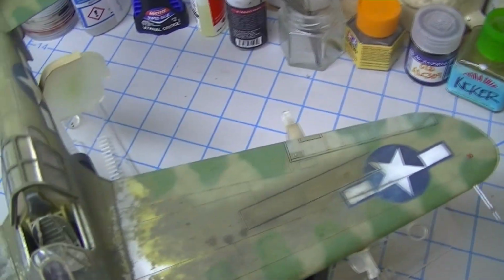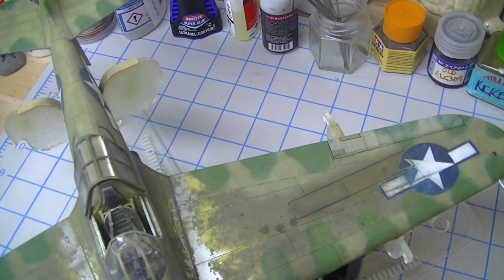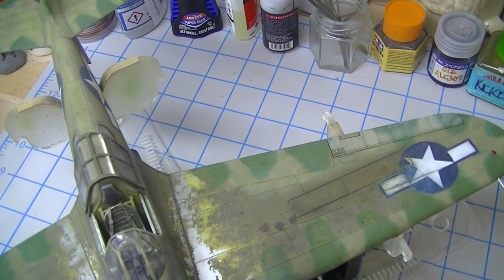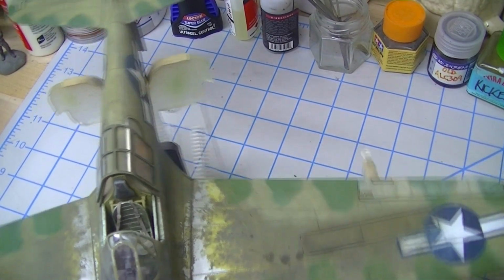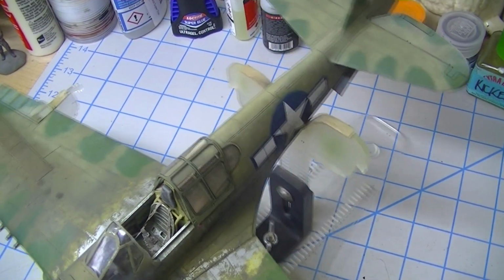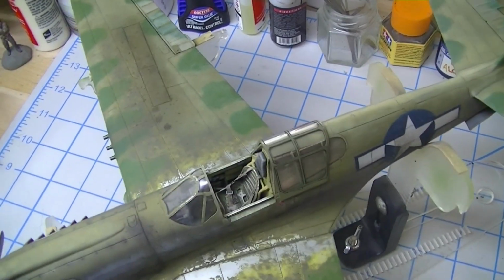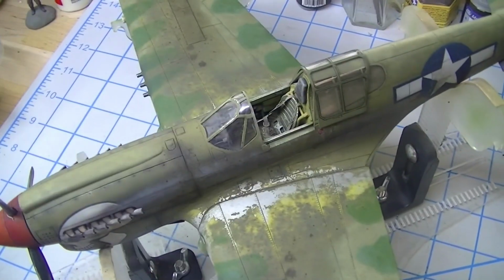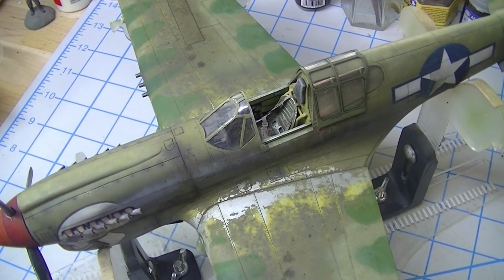It's the definition of a ghost seam, where you think it's all taken care of and then you come in the next day and it's right back again. My firm belief is that most of the time they don't truly go away. They just become less visible for some reason, and typically it's all about light. Like I'd be working in the evening, dark outside, just relying on bench lights, and I would sand out the ghost seam and feel satisfied.